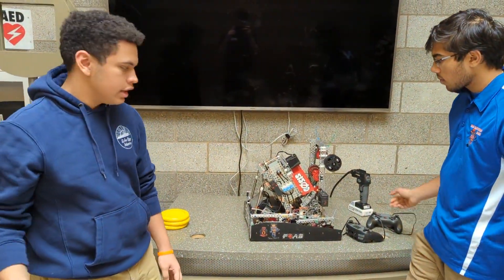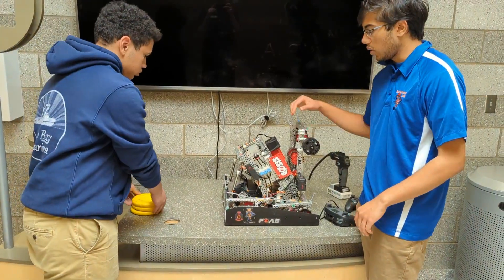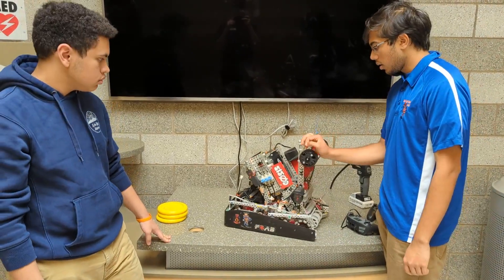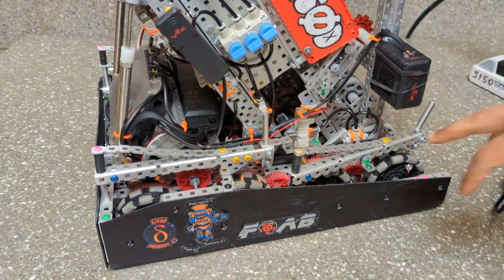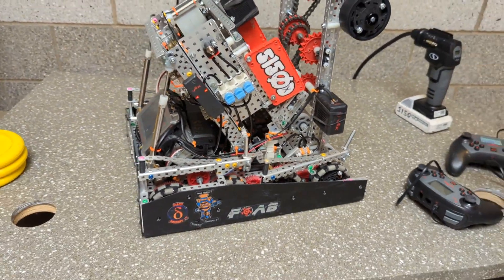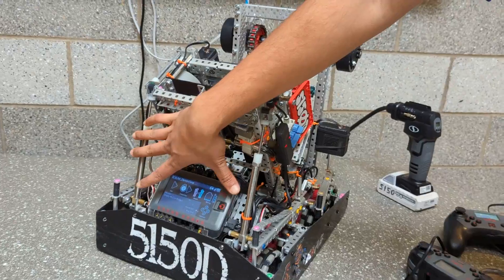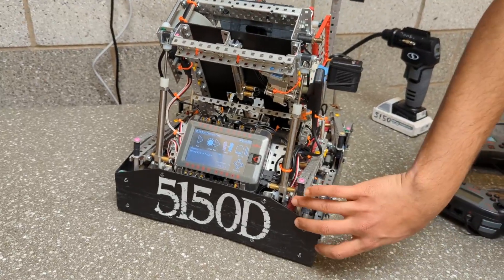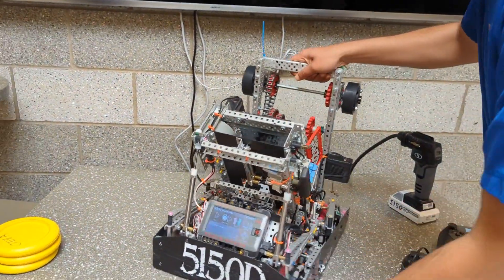Even if we got a leak, we were still able to perform endgame because those points are critical in any match. This really helped ensure that if we sprang a leak in one system, we didn't lose both systems. All of our solenoids were easy access — we found that some of them broke and we had a lot of issues before worlds. The one solenoid and regulators are all inside this back brace.